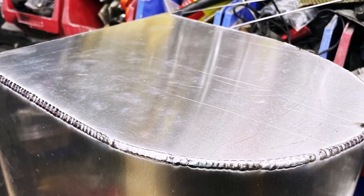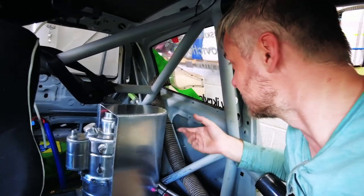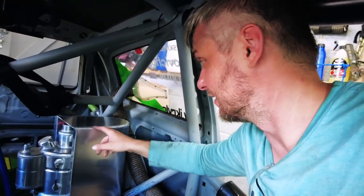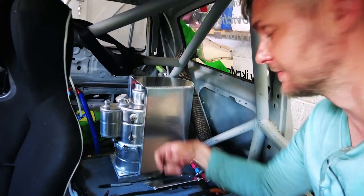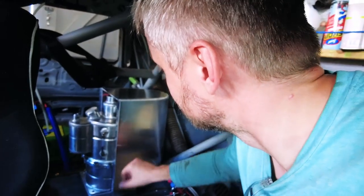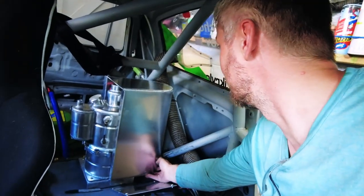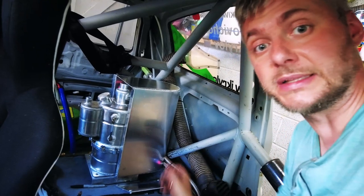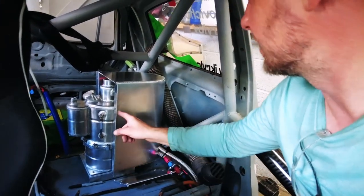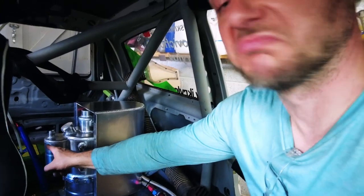So here's my TIG, and to those haters who say I'm not good enough not to use Pulse - this is actually one of the first times I've ever used Pulse and it works brilliantly on this. Because it's not really structural, it's cosmetic essentially. And there's definitely good penetration because I can see it on the back side, so there's no need to even use filler or anything - just ding ding ding ding, beautifully go around. I'm pretty happy with how this side turned out. It fits exactly how I wanted it to fit - it's clearing the roll cage, it's clearing this side, and the pipes all come in one place. So now we need to make another side, half the size of this one.